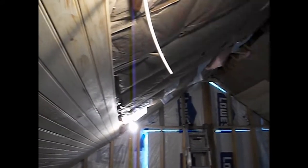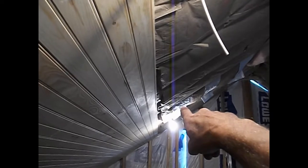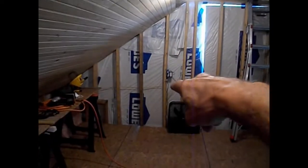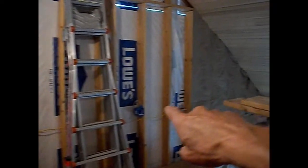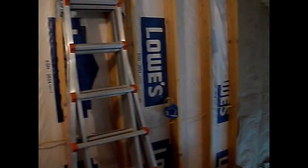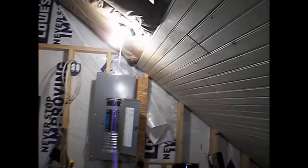Of course, I've got to do the wiring for the switch leg here, and then run another wire down to that box and tie in power for the receptacles. There's two receptacles there, and there's another box over here for two more receptacles, because I want those hot all the time so that they don't get turned off when I switch the lights off. That one will be dedicated. Always, it's got its own source, and it's on a pull string. We call it a pull chain fixture.